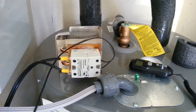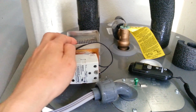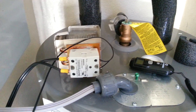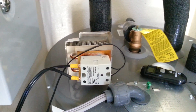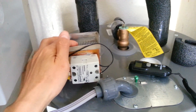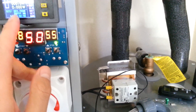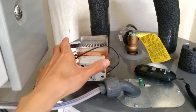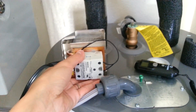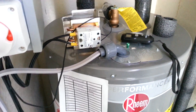I've tested it up to 25 amps, but at that level you definitely need a big heatsink like this, and you're probably going to need a fan too. On my other setup I'm pulling 22 amps at 50 volts — that's about 1,100 watts — and I did have to add a fan because it was getting fairly hot. But for this setup I'm only doing about 100 volts at 10 amps max, so it doesn't need a fan and it rarely even gets hot, only up to about ambient temperature, which is about 90 to 95°F here in my garage.